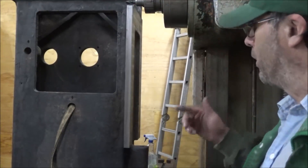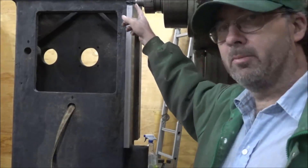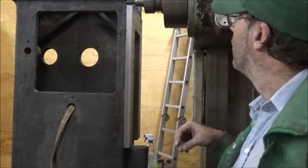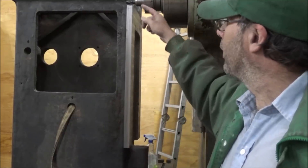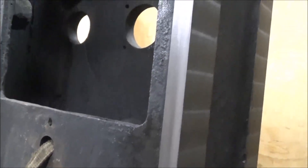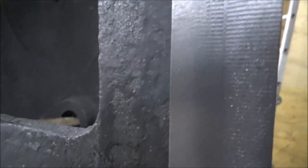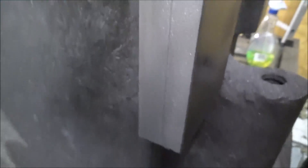I went and got this other end mill — it was the one I could find that was closest to having zero taper — and I've come back and run this up through here. You can see the pattern blend out because it's not cutting on the far end. It'll just have your cut on this front side, which is what needed to happen for this to come out square, and I'm pretty happy with it now.